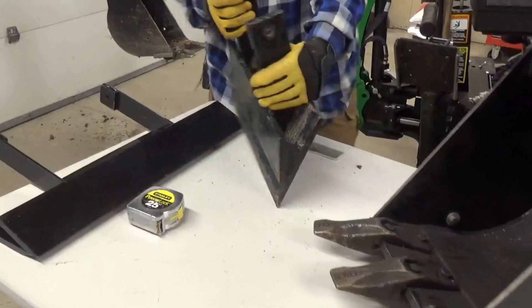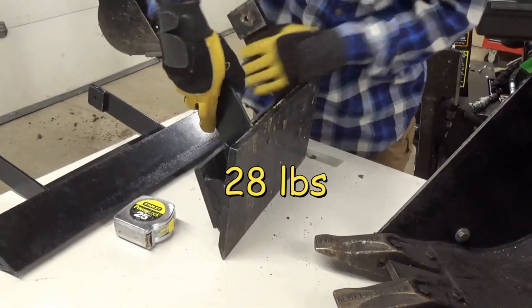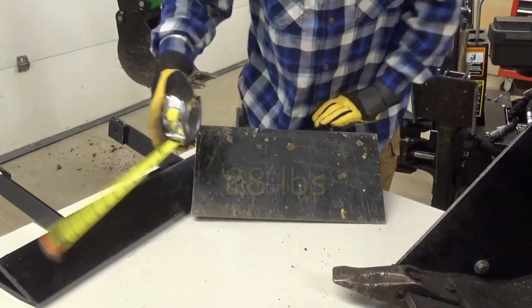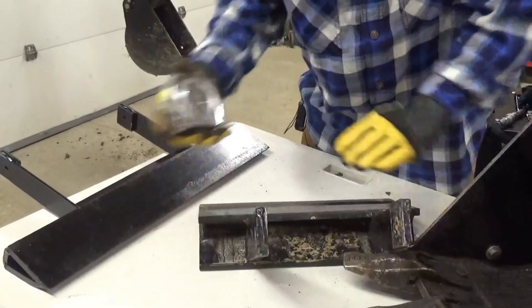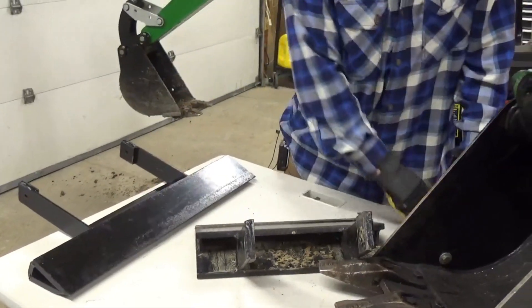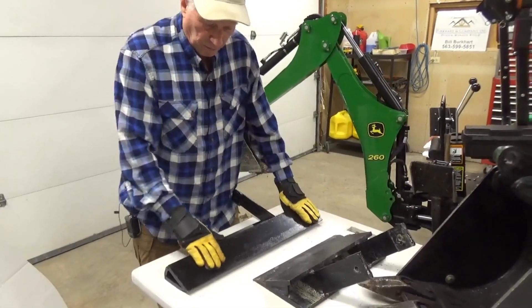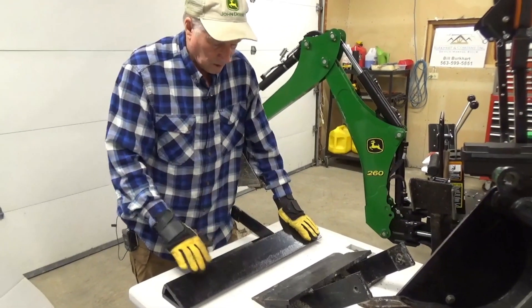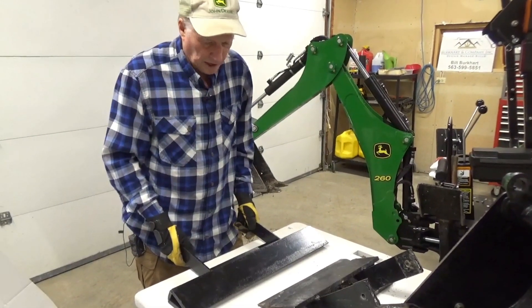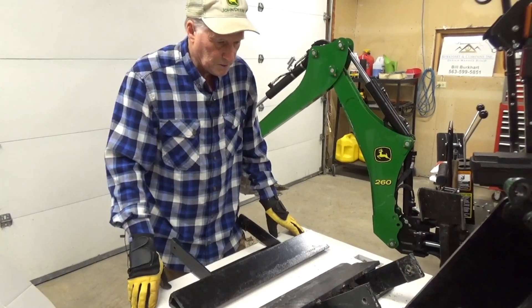Now likewise, the blade that I did last time — let's look at that. Same type of design, but it's got a lot bigger face. I found this is pretty handy when I'm backfilling because that face is eight inches, and then the front face is about six and a quarter inches and 15 and a quarter inches wide. So they both work pretty good. A couple of viewers on the Facebook page that I joined recently talked about wanting a real nice wide one for cleaning out ditches. So this 24 inch might be real nice for that. I don't know if a guy couldn't go 36 inches — we might just do that if we get some time on our hands soon.